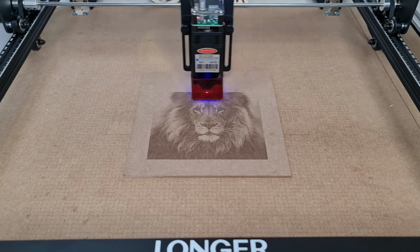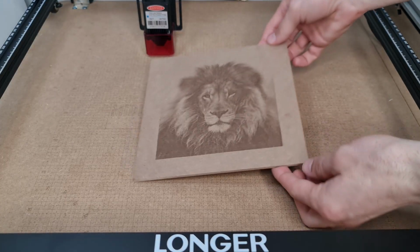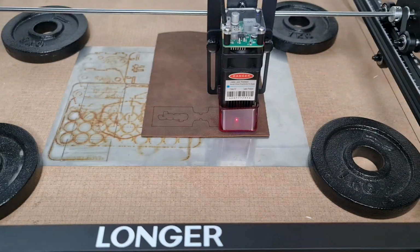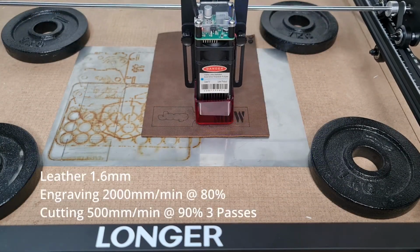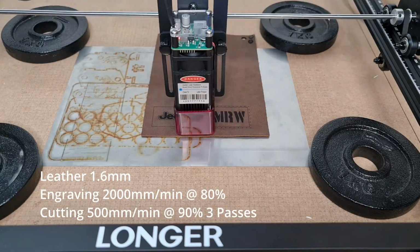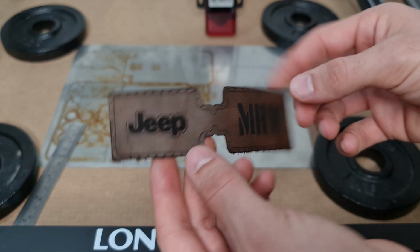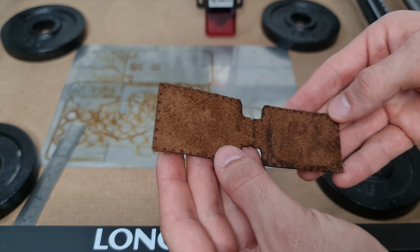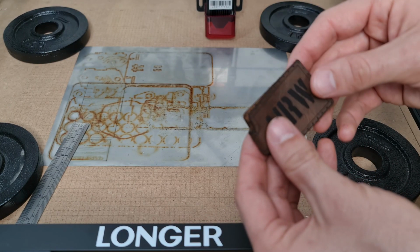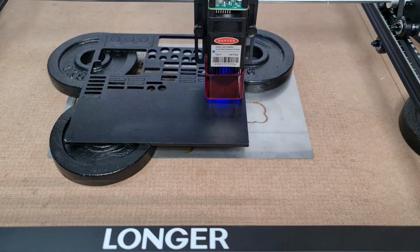As per cutting, you will be able to cut through natural materials, again, wood, plywood, MDF, leather, and plastics like acrylic and ABS. I mean, the limitation is only how deep you can go. This is normally given by the focal length, the hot part of the laser. But for a laser like this one, you can easily handle 4 to 5 millimeters, and sometimes also all the way up to 8 millimeters. And so it all depends.